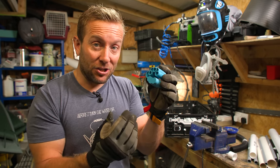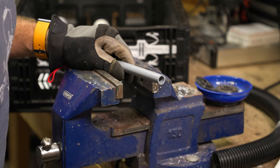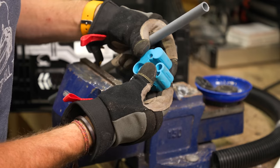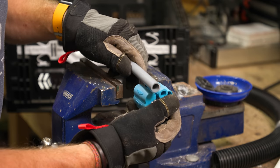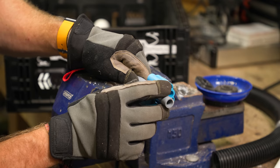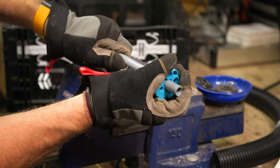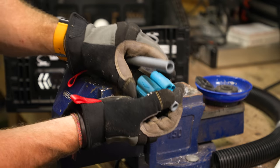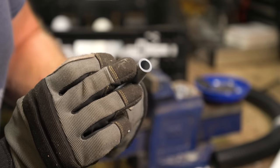Let me demonstrate now how you'd use it. I'm just going to do it on top of this vice here. So look, inside if I just split this apart, there's our blade just sat inside there. This is a bit of 15 mil poly pipe. There are the arrows on there, so if I was going to cut this bit of poly pipe, I could just pop this on here like so. And this clamps round it straight away, making sure that our cut is nice and square. I can just twist that a few times and it's already cut it. Literally, that's how quick this thing can cut it. And look just how clean the cut is on there. Absolutely lovely.